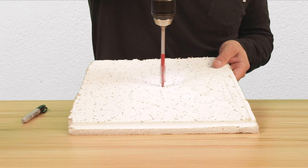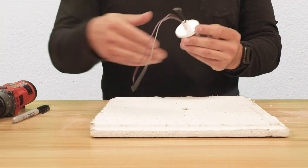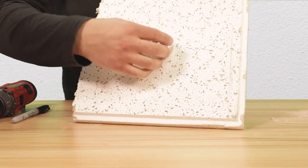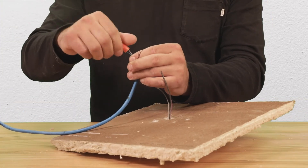Using your hole saw, cut a half-inch hole into the ceiling tile. Remove the 3M tape from the back of the daylight sensor. Feed the wires through the hole and secure the sensor to the ceiling tile. Finally, connect the dimming wire from the sensor to the light fixture.